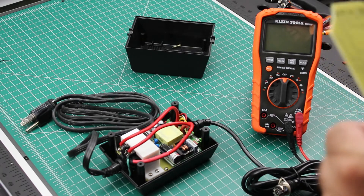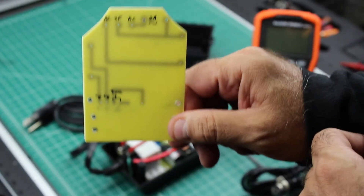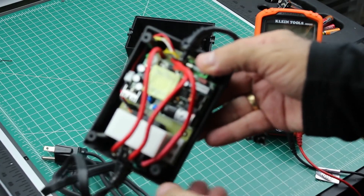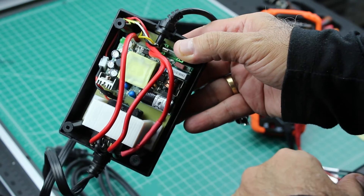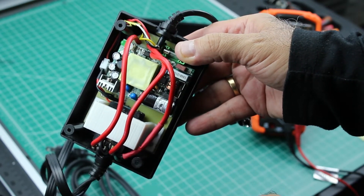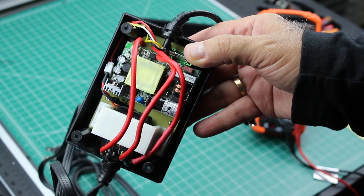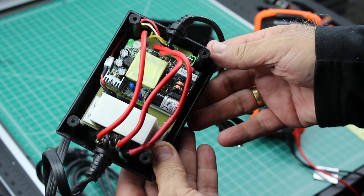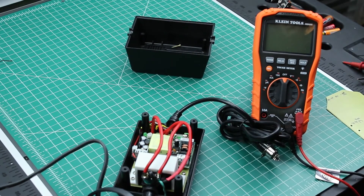Okay, so we have everything wired now. This is the bottom of the circuit board — all components get mounted on the top, and I'll leave the layout and schematic in the description. What we have here is one of the AC leads coming in, going through the fuse, and then back to the transformer — that's the hot. The neutral is soldered straight to the transformer. On the left-hand side I put in a four-wire plug for the voltage going to the C64 DIN. Let's plug this in, check the voltages, and then weigh it.